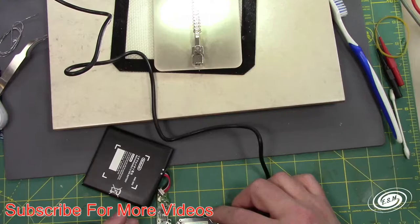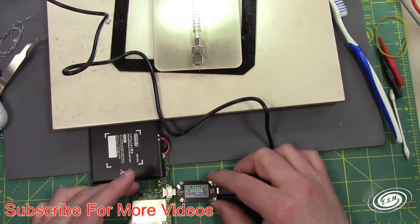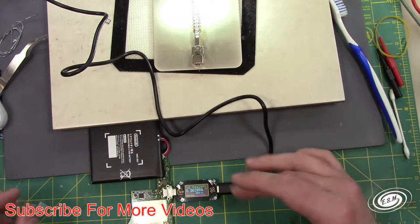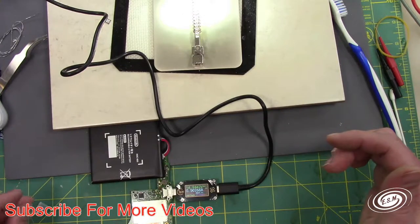It's drawing 0.5 amps. So I don't know if that's normal or good. So that's what it did before. So I don't know. What do you think about that? The 0.5. Oh, you can't see that. That's what it's drawing on the meter, which is like 28 milliamps higher than what it actually draws, because this meter draws 28 milliamps. So that is drawing that kind of current.